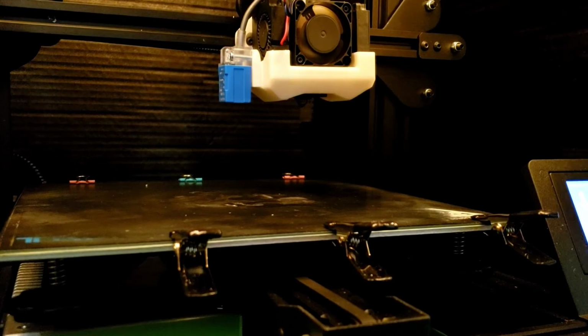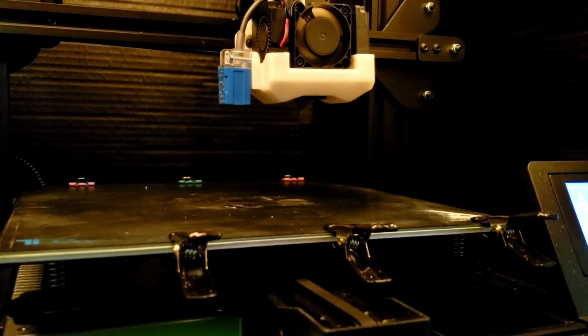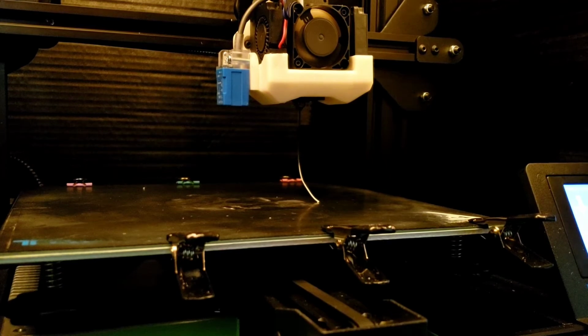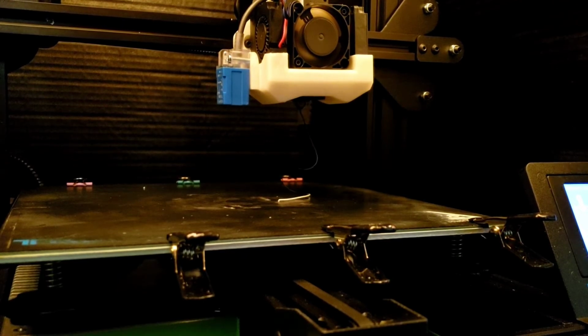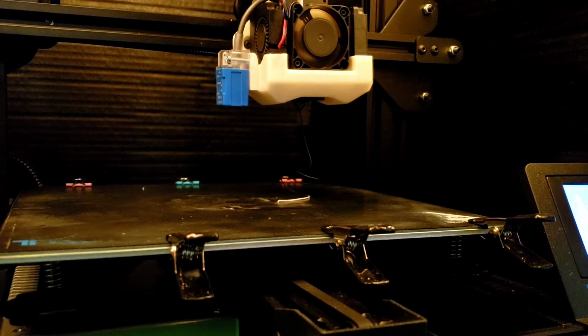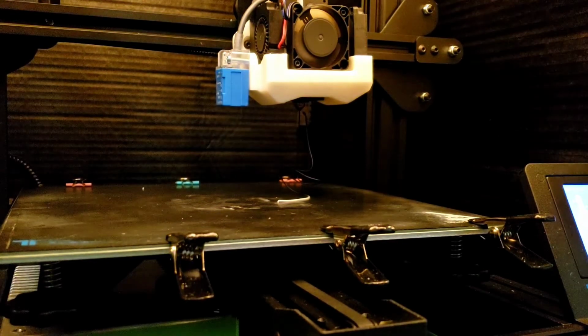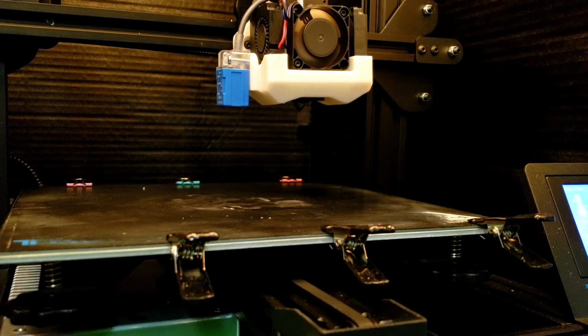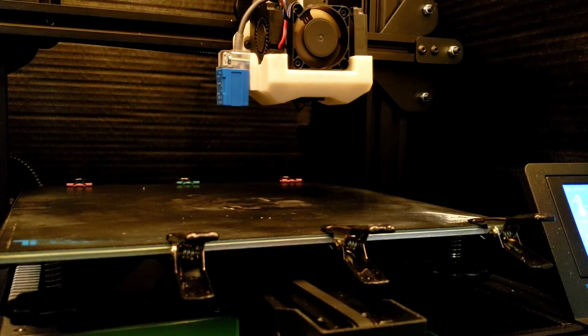Okay, we're running our PLA through. So I had white ABS, or natural ABS, and we're pushing that through by hand right now. I'm going to be throwing that black PLA in, what I used to print the Mandalorian helmets. It's been sitting in the open. It's been mistreated. We'll see. I cut like about a foot off. So it's kind of crunchy. Let me turn the temperature down now that I got the ABS kind of pushed out of there. There we are. Pull this glob out the way. It doesn't sound too bad pushing it through, so we'll see how it prints.